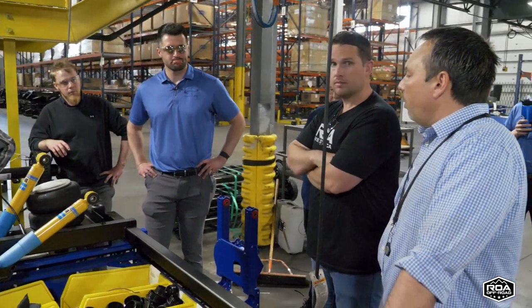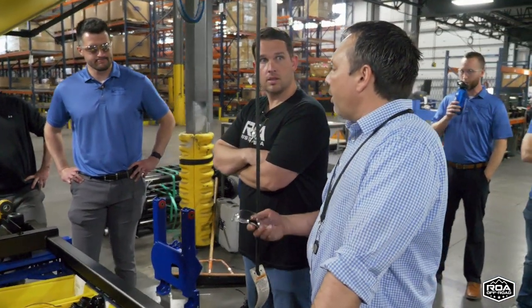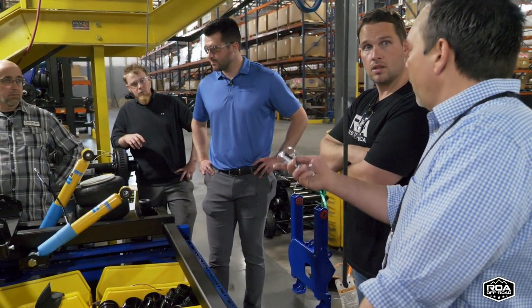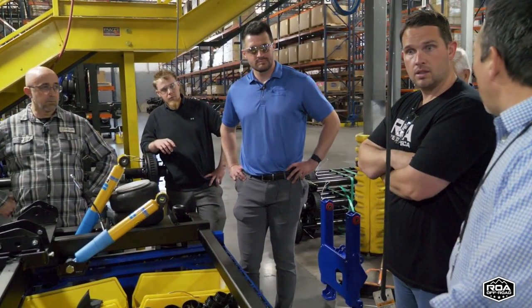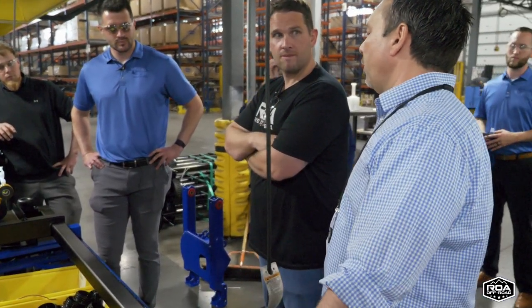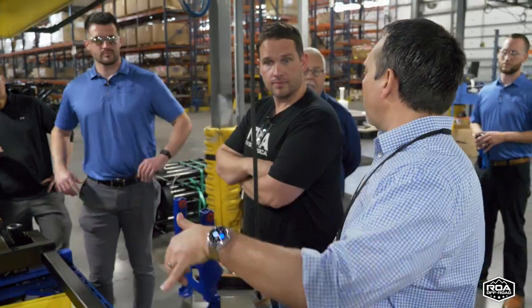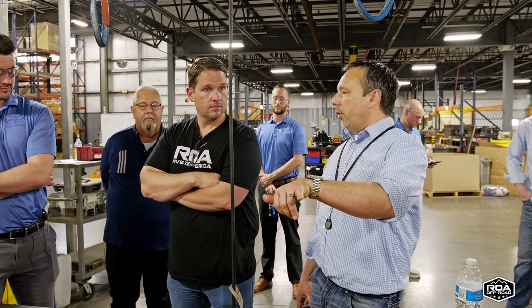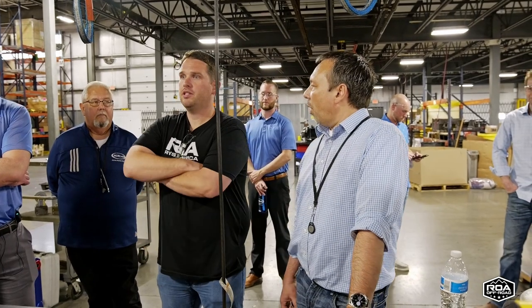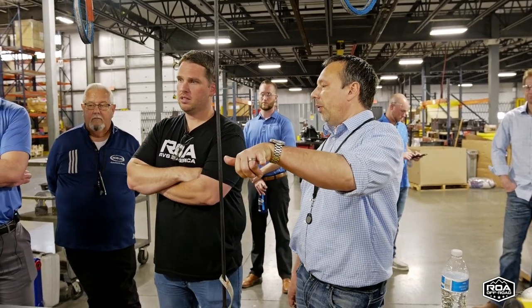Well, we still have to send out the information on the speed requirements, but we want to be able to get home. So if you blow a bag, our control system monitors for it: it suddenly sees the peak pressure change and hits an angle, then it double checks and tries to fill. If it can't fill, it dumps and bolts onto the bump stops. That way, as you're going down the road, we make sure we're safe.